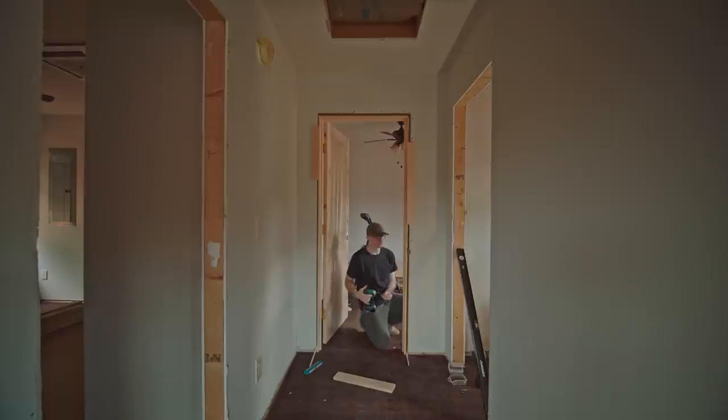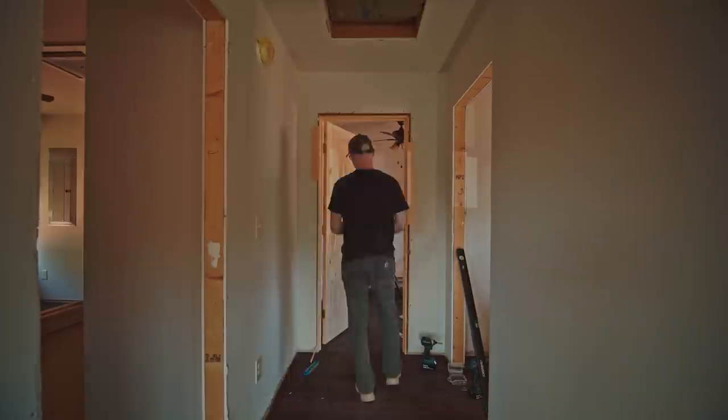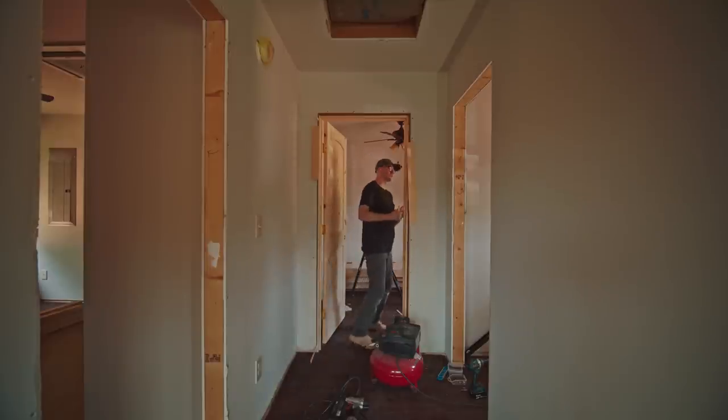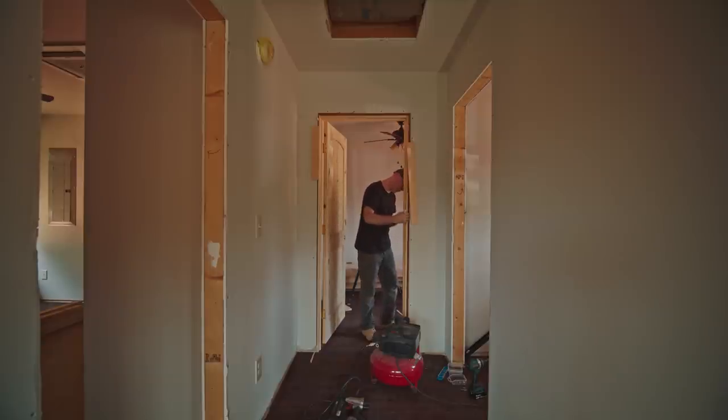I'm checking for plumbness and putting shims in. I'm putting the screws inside of the wall plate cavity to hide those screws — once you put the plate on there you won't be able to see them. I try to hide as much of those screws as I can so when I put wood putty in I don't have to do much — it looks clean, no big screw holes everywhere. Trimming out is basically all about hiding things; that's just how construction is.